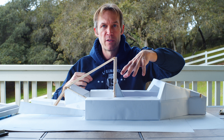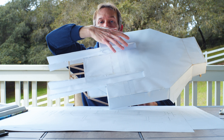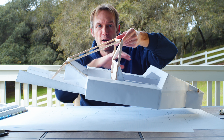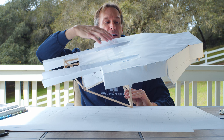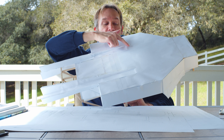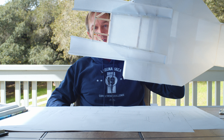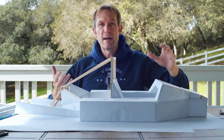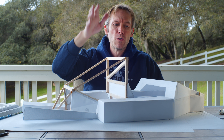There's some engineering that goes into where you place the start of the tunnels — where you have the throat of the venturi you're creating for ground effect. I'm trying to pick a position I can play with later. I could put blanking material in to have the tunnels start further back, adjusting the center of pressure to get the right balance of aerodynamic load on the front and rear. I could also add a little hump and fins to move the venturi further forward, relying on skirts. We could try different ride heights, vortex generators, and seal the sides that way — like they're doing in Formula One now. This is just something to learn from and tinker with for years.